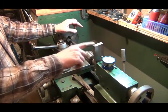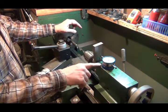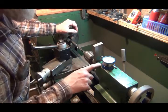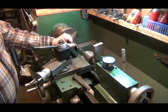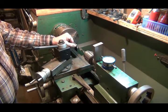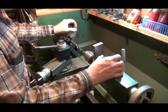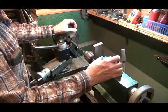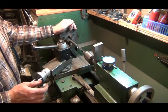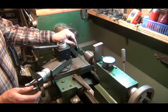I put my little stand in here and preloaded an indicator about 3/4 of an inch or so. I'm going to start drilling my hole, and as soon as I see that I have the full diameter, I'm going to set this at zero so the needle is right on zero. Then I'm going to go in — actually probably 9/16ths of an inch — just to give a little room in the bottom for some epoxy.